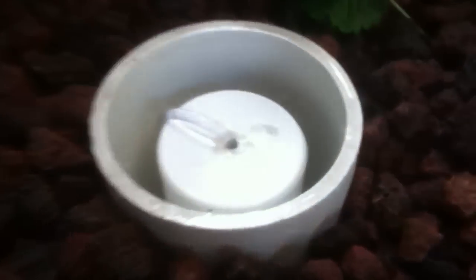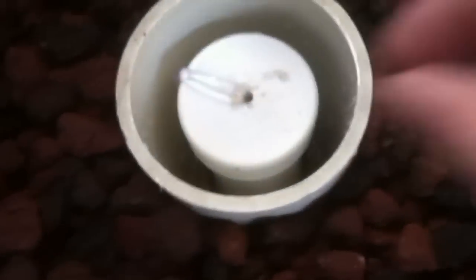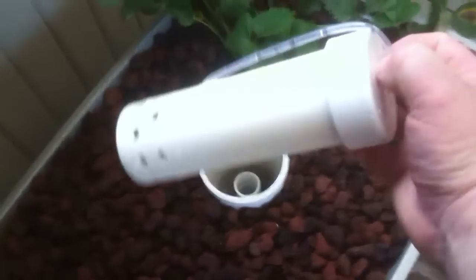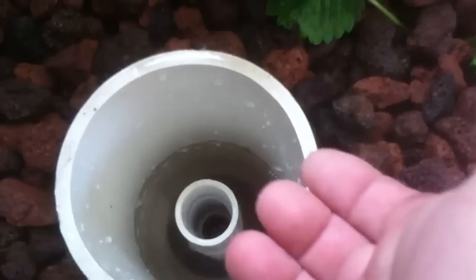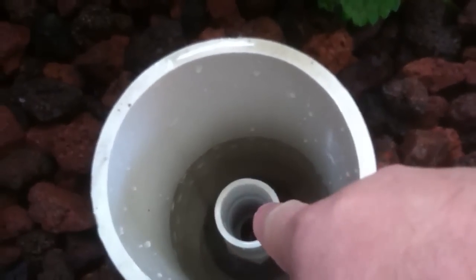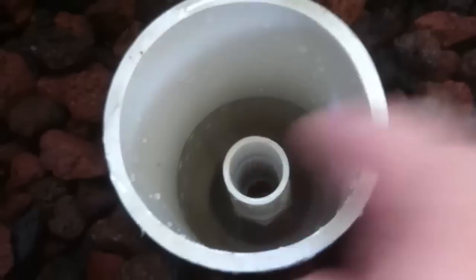You can see here in the middle the bell valve. I can pull this bell valve out so you can see what it looks like. It's a PVC tube with some holes in the bottom of it. The center tube is what determines the fill water level. As water rises and reaches the top of this center tube, it then begins to overflow and that's what generates the siphon with the bell.